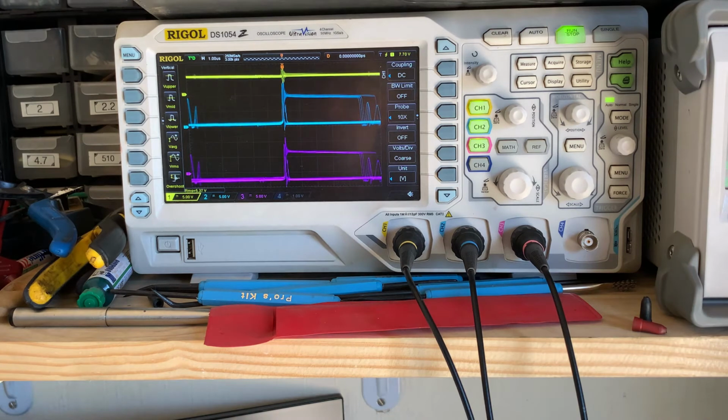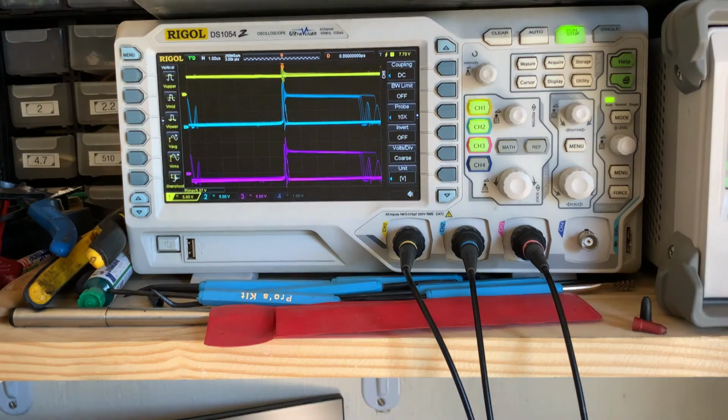Let's go all the way down to 3 volts and we'll see what we get there. So we've got roughly 5.5 divided by 180, squared, times 180. It's 168 milliwatts. Our power supply tells us 296 milliwatts of input power, so we divide 168 by 296, times 100. That gives us 56.77% efficiency. Interesting.